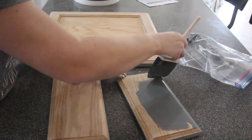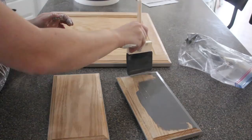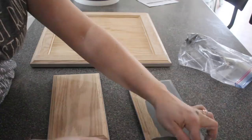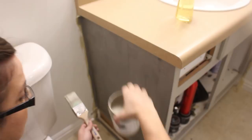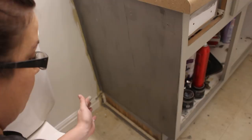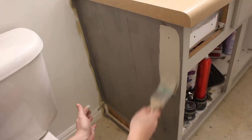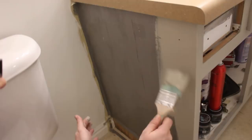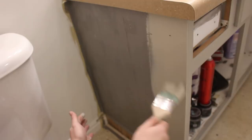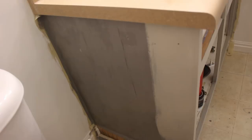This color does not go well with this cabinet, so I'm switching it up to fieldstone from Fairy Chalk Mother — you can buy it at jamierayvintage.com. It's lighter, more of a grayish which pulls in the brown tones from the countertop. I'm going to use my two-inch chiseled brush because it gets the paint on there pretty good and fast — the coverage is pretty great. Then when it dries, I'll take 400 grit sandpaper and smooth it all out so you don't see any brushstrokes. Sometimes you have to change things up when the color just isn't right.